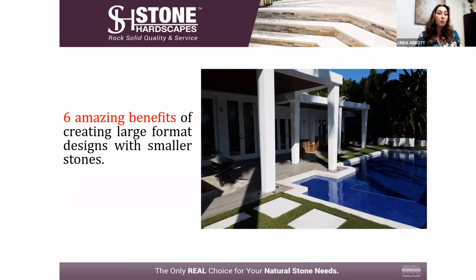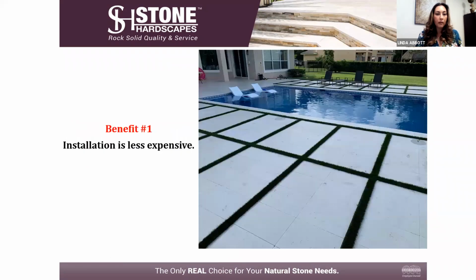So I'm going to go over 6 great benefits of creating a large format design using smaller stones. The first benefit is the installation is less expensive. The reason being is that when you're using a large format paver, 24 by 36, 48 by 48, or even larger, those larger slabs are very heavy. And it's going to take more manpower to actually lay the stone, whether it's 2 to 4 men. If you're using what's shown here, which is a 12 by 24 paver, it only takes 1 guy to lay the stone. So you're saving on installation costs in regards to the manpower needed to do the job.